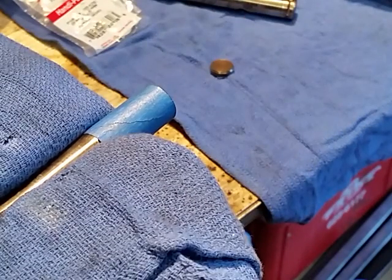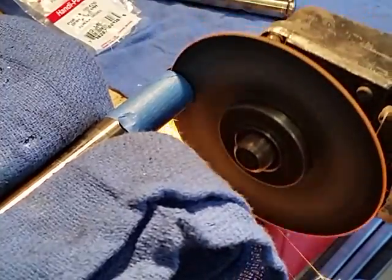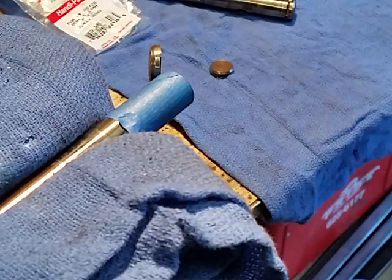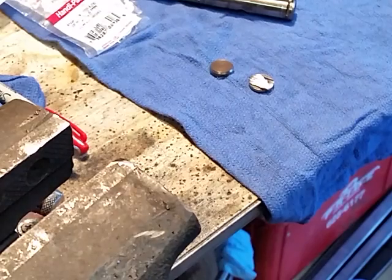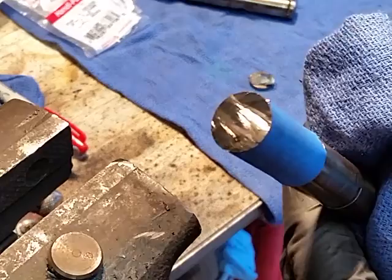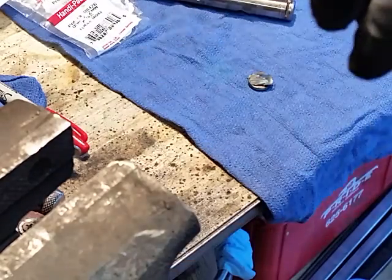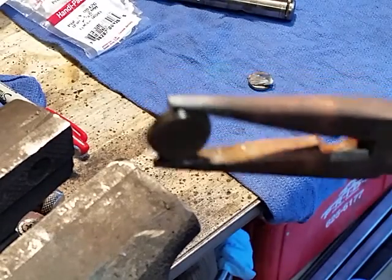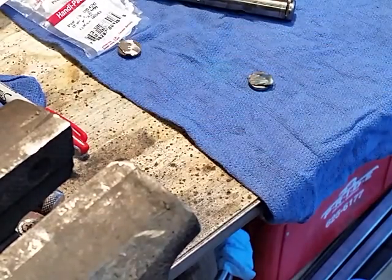There's one cut, and there's the second cut. You can see basically how much I took off on each end — this end is nice, flush, and straight. I'll touch those up on the grinder. Here's basically what was just taken off right here — just a chunk of the piece — getting rid of that area that housed the clips.